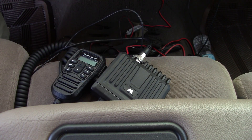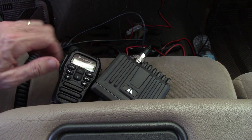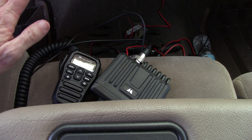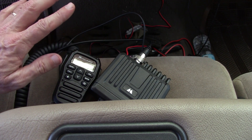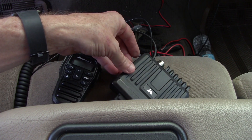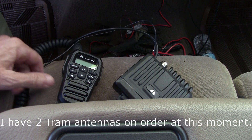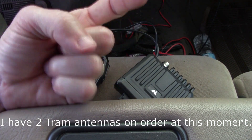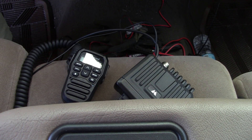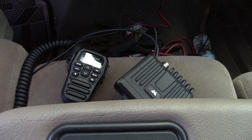But when you couple a quarter wave with this long, lossy coax it's just too much to get any good range. So if you're getting no range out of this thing, I'd highly suggest upgrading the antenna. GMRS is in a popular commercial UHF band, so there are a lot of antennas out there at good prices. Larson and Laird are very good brands. Tram and Browning are good in the budget range — they do ham and commercial stuff. The Browning 5/8 over 5/8 up top is a budget one, around $25.